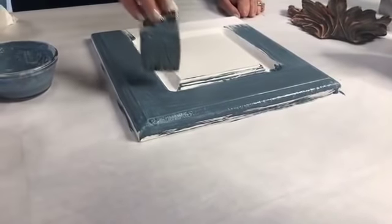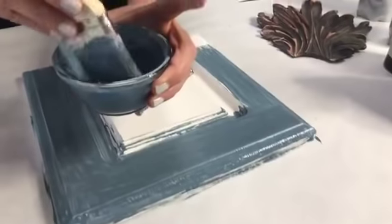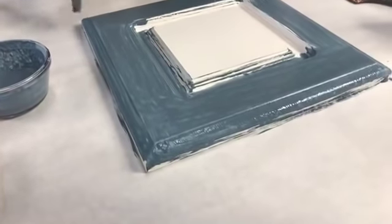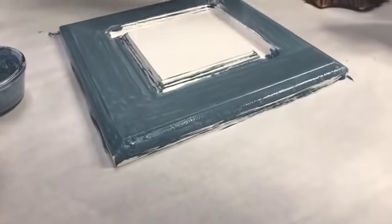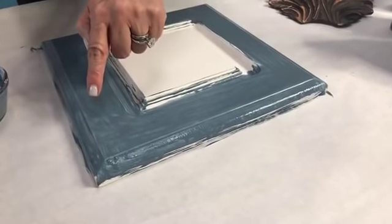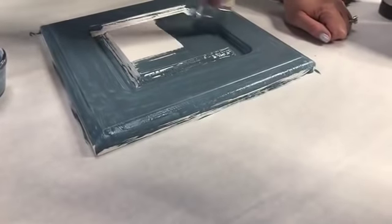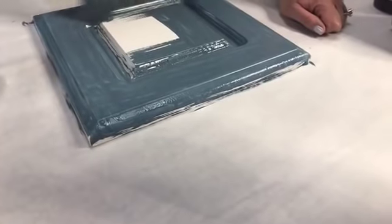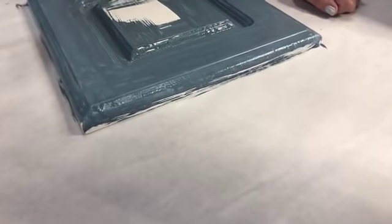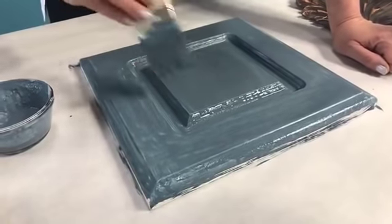You're going to see how incredibly beautiful and easy working with my milk paint is. Look — as I dip my brush back in, I'm agitating it because the pigments and water tend to separate. You just get used to it, like knitting — you keep agitating as you work. It's no big deal and it flows out beautifully. It's going to dry down much lighter than it looks wet, which allows you to come back and antique it. It gives a beautiful finish on furniture.